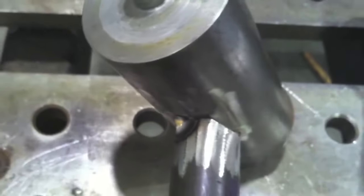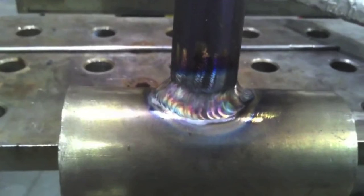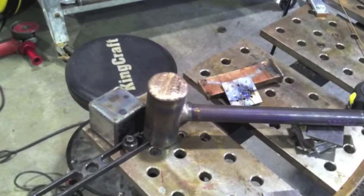I chose this little project — it's a scrap piece of two-inch round stock welded to a one-inch handle — just to show how thick you can weld using multiple passes and by putting a little bevel where it needs it. You can usually get a stronger weld just by doing a little joint preparation, a little chamfer here and there, to get deeper penetration. TIG welding is only going to penetrate so deep no matter how much amperage you use, so 160 amps will weld almost anything. I also overlaid the face of a hammer with silicon bronze — you can do delicate artwork using silicon bronze rod, but in this case it was very functional: I wanted a softer hammer face that I could use on stainless steel parts without risk of contamination from carbon steel.